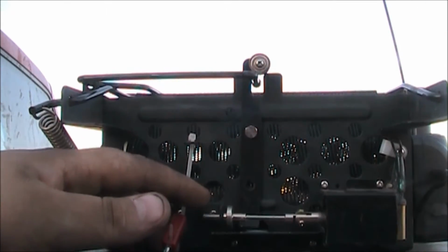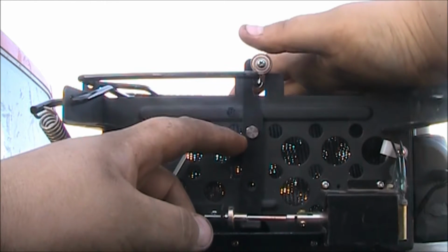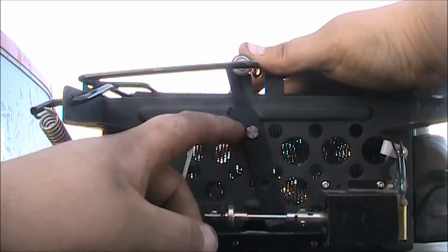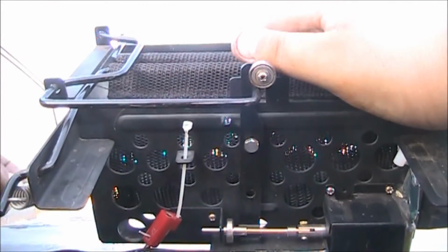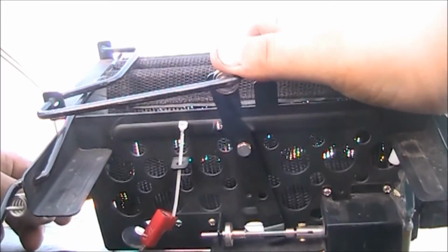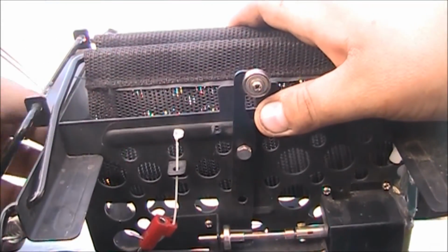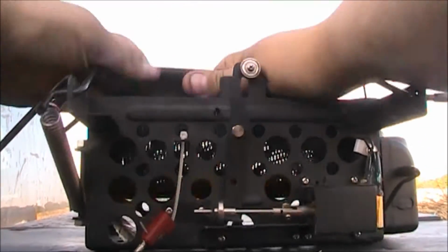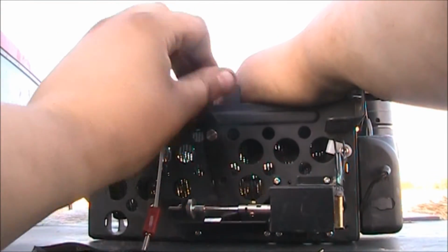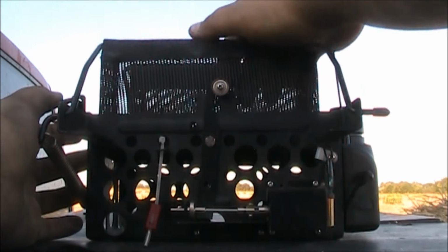The way you launch is this arm right here, this lever, is activated to roll backwards. When we roll backwards, this wheel rolls over this, and whenever it rolls over, this swings back, which leaves no pressure on the cradle whatsoever. This folds back over, relieves the pressure from the cradle, and the cradle pops open like this. I know it's kind of hard to see, I'm sorry. I'm doing this just me in an awkward position, but this cradle moves back, slings open, and that leaves the cradle to come up.